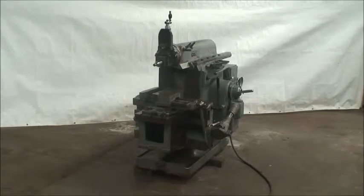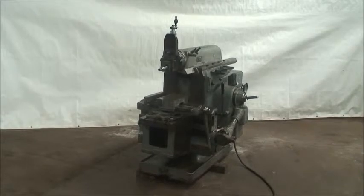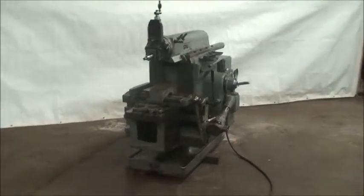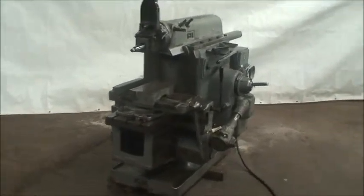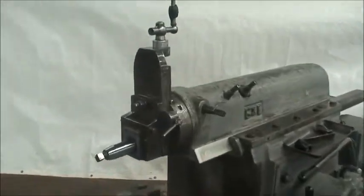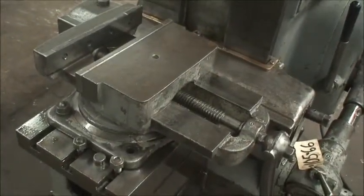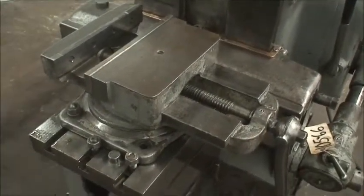That's by the book — we did measure 15 inches. Strokes per minute are 12 to 200, with 16 different speeds. Head vertical travel over here is 7 inches. It has a table size of 12 by 14 inches, and 20-inch horizontal travel.